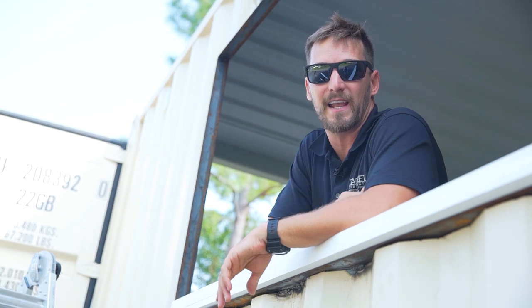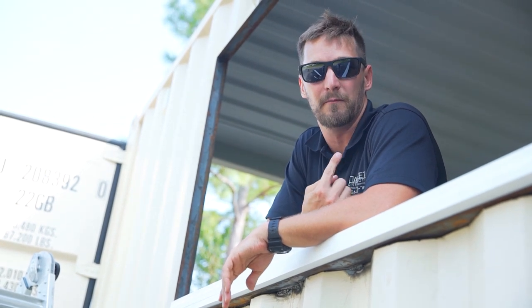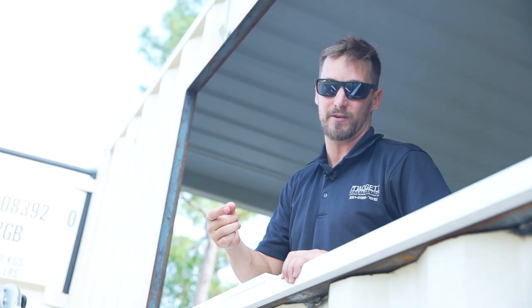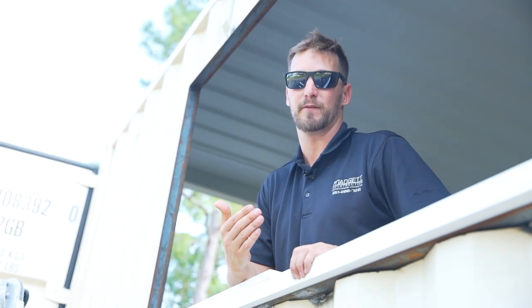that's gorgeous. All right, let me see if I can find an installation instruction on this thing. So I tried to jump the gun a little bit and I built my frame for my window before I actually got the windows, and I went off the specifications that they had online. And what they had online was apparently the tip-to-tip dimensions, not the buck dimensions. On my frame, I added a 3/4-inch board all the way around on top of the dimensions that they gave me online for the specifications.